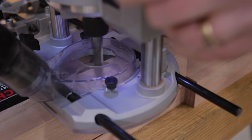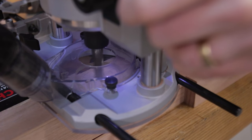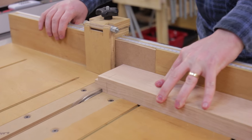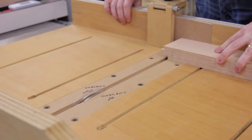For joinery I went with integral mortise and tenon. Using a plunge router and a half-inch spiral upcut bit, I plunge at the start and stop points of my mortise to full depth, then work my way down between those two points taking a few passes. The tenons are cut using the crosscut sled and a half-inch dado stack. I nibble away at the tenon until I hit the stop block.